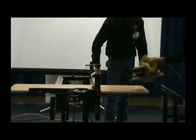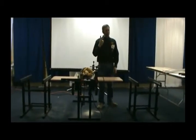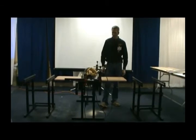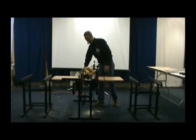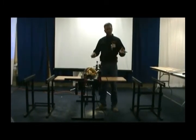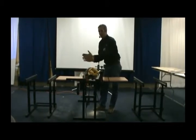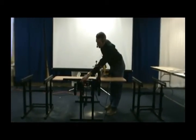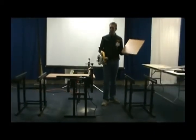Underneath all of the clamps for our equipment is a neoprene rubber, about an eighth of an inch thick, for two purposes. One, it holds your product very firm, doesn't move for cross-cutting, and two, it protects the surface of the wood, so it's not going to scratch it or do anything. If you're working with wood, that's $100 a sheet, okay? If you feel you need to, you can always put this here, and this would stop any kind of movement, okay? I never use it, but you can use it. And then basically, it doesn't get a whole lot easier than that.